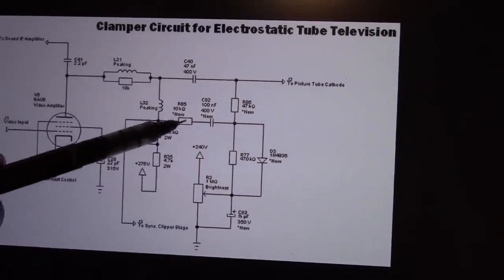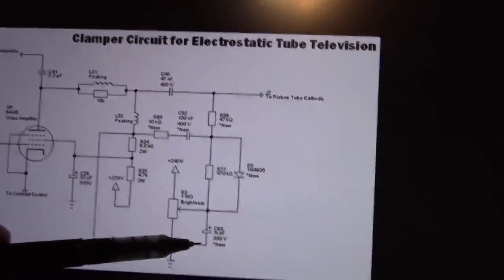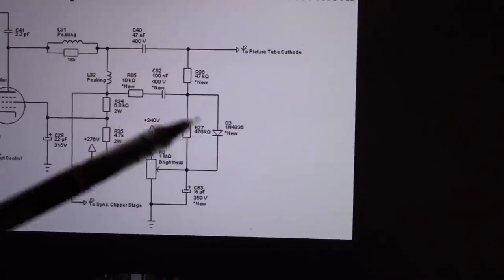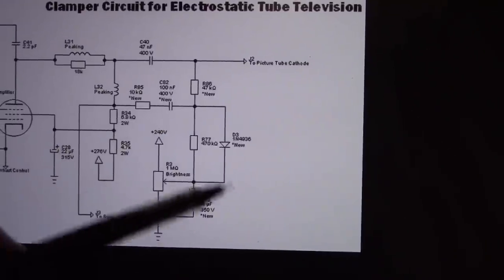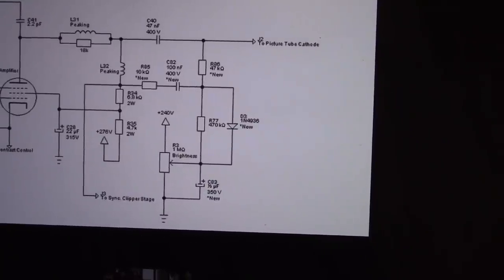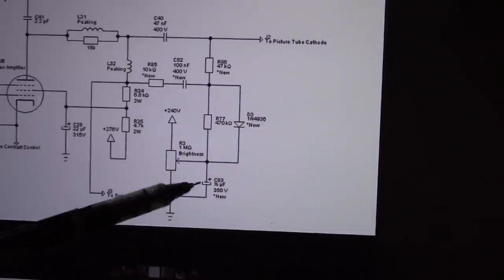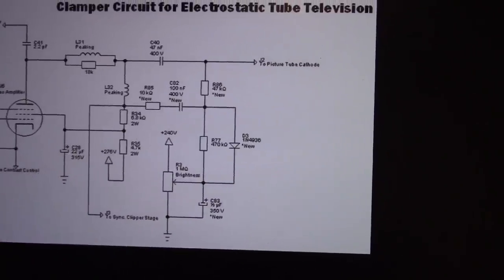So we need to add in a resistor and a capacitor and another resistor and a diode and a half microfarad cap. So I think I ordered up a few of these diodes a while ago. I gotta dig through my stash and see if I can find them, and then we'll wire in these new parts. Hopefully we can find somewhere in a terminal strip that will be fairly convenient. Brightness control, we can strap the capacitor right across the existing arm, wiper and ground. And this stuff, well, we'll have to see, make it a little ugly, but we'll see what we can do.